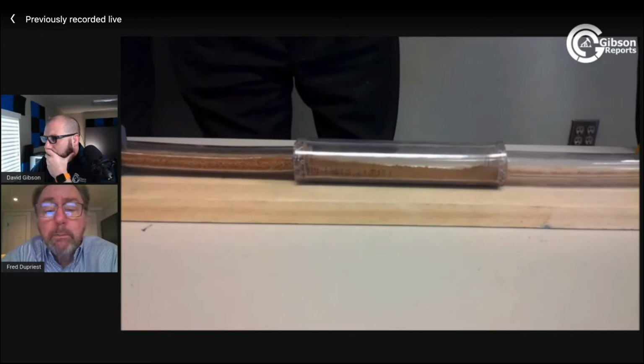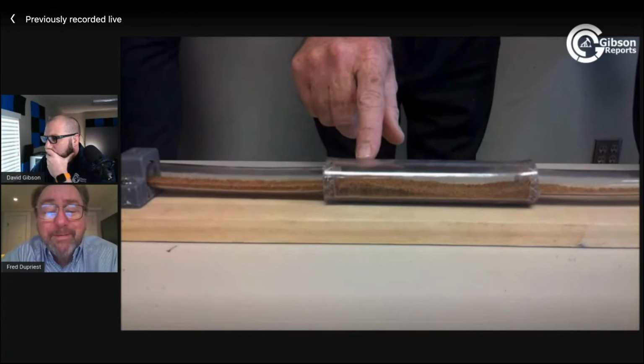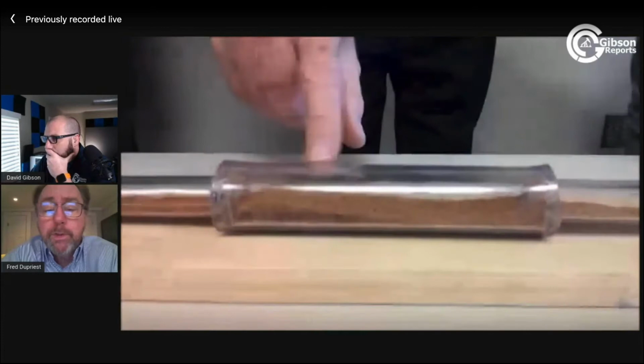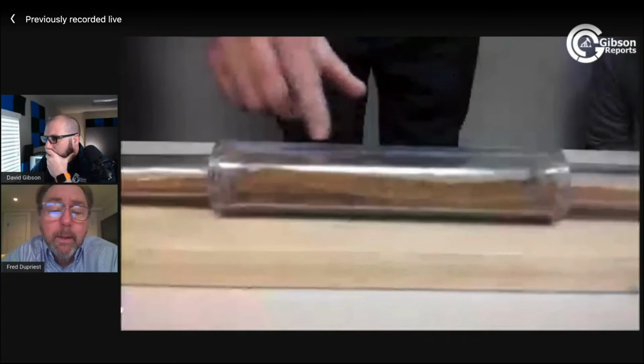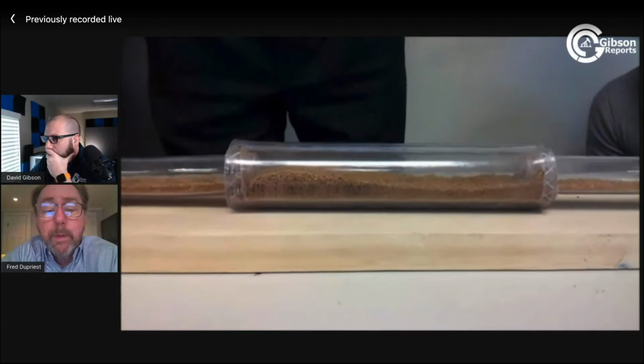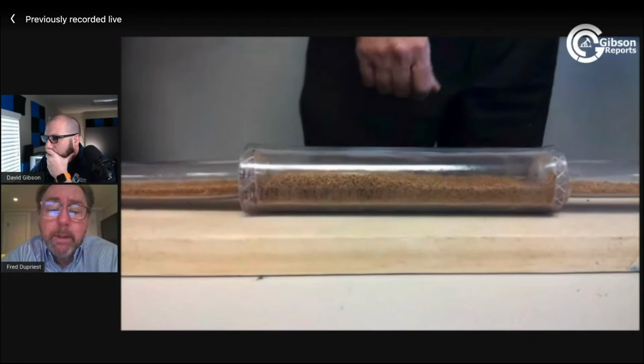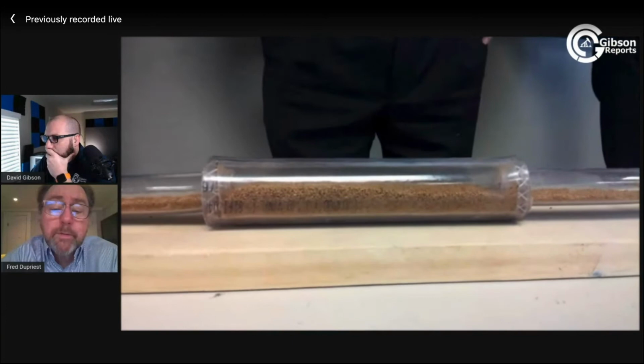If I went in and took the trouble to clean all this out, key point, it's worthless. I go back to drilling and this is going to fill back exactly to the same equilibrium bed height in the enlargement that I'm about to create right now. Even within that enlargement, you see it builds to the equilibrium height at the early part of the enlargement. And it takes a while to actually fill it all the way to the end, because the stuff to the right is still moving out until the bed height gets to the equilibrium for the enlargement. So these things refill almost instantly. And if you want to manage it, again, raise your mud weight and don't allow it to happen in the first place. Because if you allow it to happen, from now on, this is what you're fooling around with here.